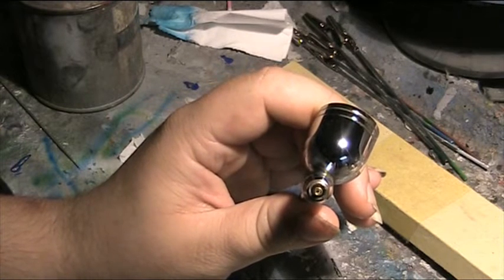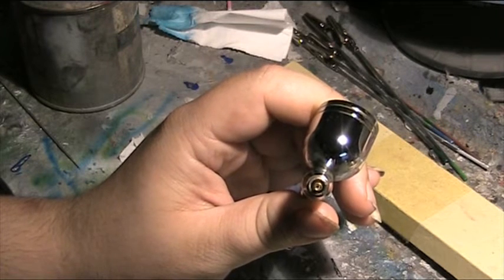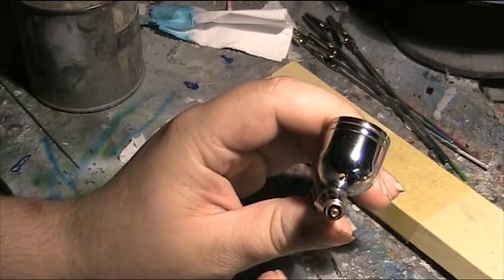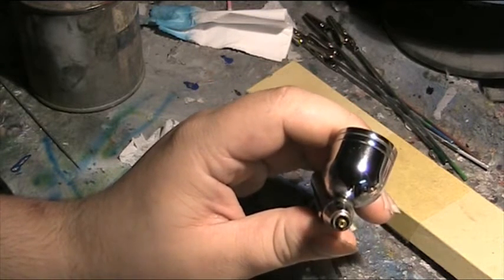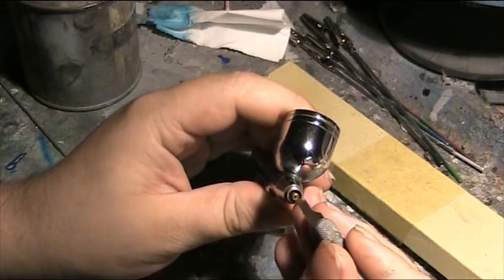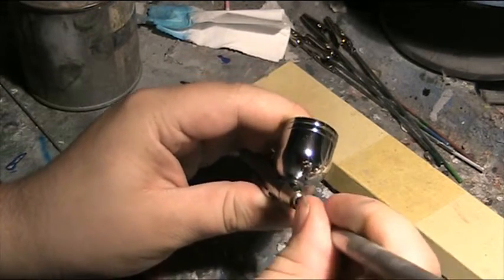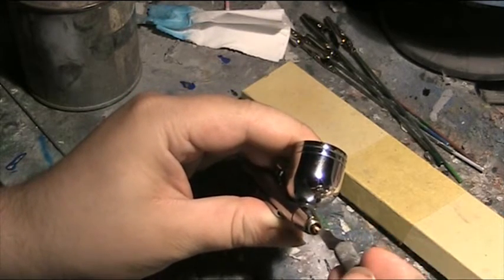It's going to be quite tight. There are a few ways around it. Normally with an old-fashioned scribe or these new hole-poking nozzle tools you can jam it in there and twist it out. I haven't purchased one of those, but the few times I've fixed it I've used a hobby knife — a little blunt is a little better. I just dig it into the brass and screw it out.